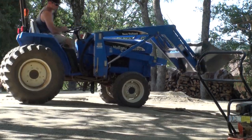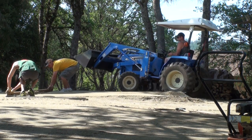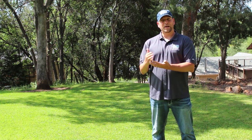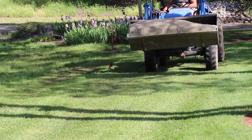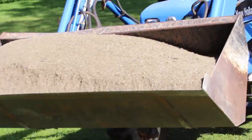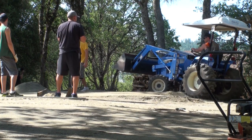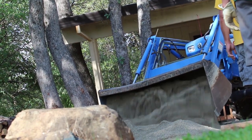After we get done with that road base, we're going to come in and put in 3 to 4 inches of decomposed granite. Some parts of the United States call it stone dust. Basically what we want is a 3/8 minus product that goes on top, that compacts real tight, but also is really smooth on the surface so you don't feel any type of bumps or any type of inconsistencies on that product.